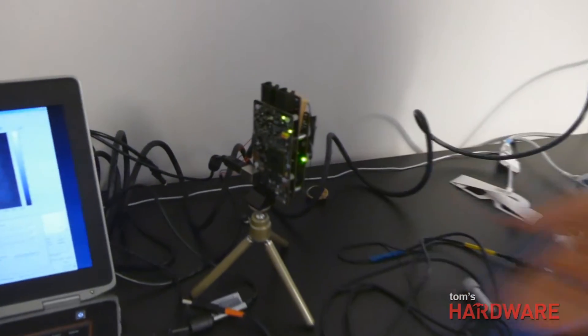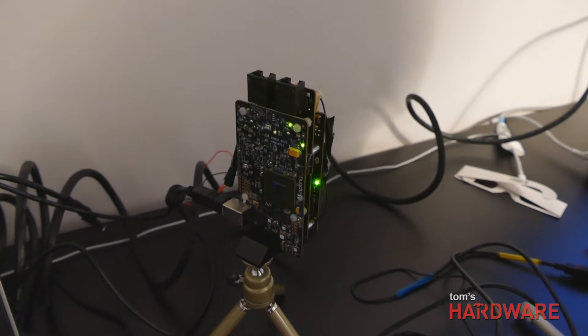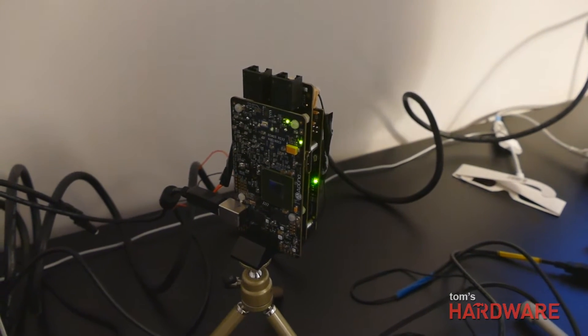Here I have a standard photodiode array where we've replaced the cover glass with a tiny diffractive optic — a diffractive optic that's only 55 microns in diameter, a little bit smaller than a typical human hair, and it doesn't produce a focused image. Instead, it produces something we're calling a blob, that a computer algorithm can interpret and then reconstruct.